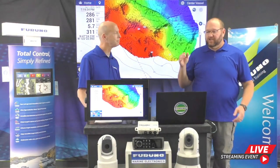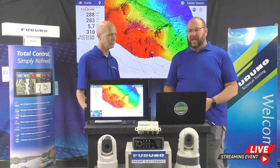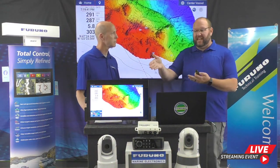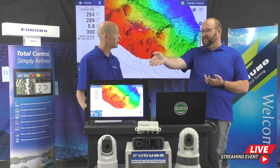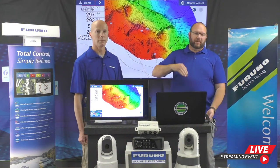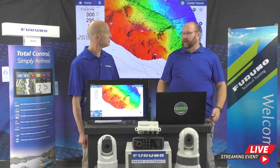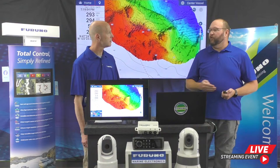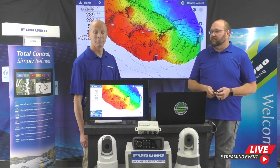Perfectly smooth, yep. So with the SCX20, you do need to set in some parameters, but that's really easy because there's actually a setup and you're right in the TZT3. Yeah, you bring it up and you just put in some dimensions of your boat from the keel to the antenna, the width, the length, where you have sensors at, and it will improve the accuracy of that data.